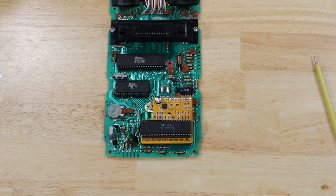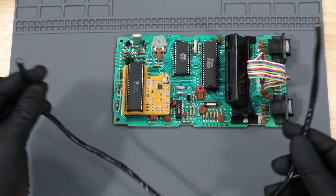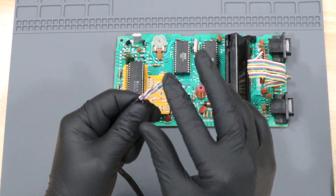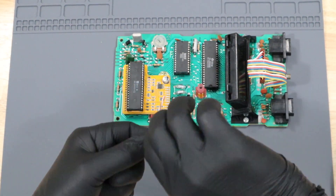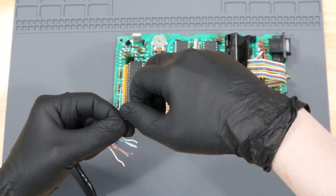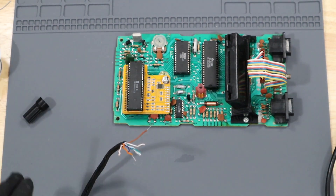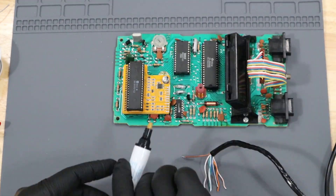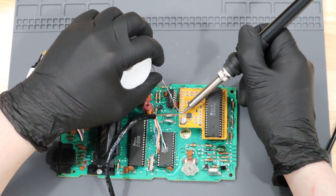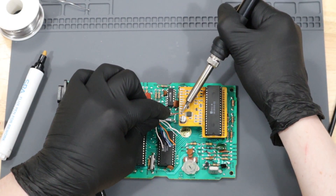Now with that installed, it's time to start soldering on the wires. The kit just came with a Cat5 cable. There are additional ground pads on this chip, so I'm only going to be using one of the wires for ground and just ignoring the other pads. By doing that I'll actually have enough wires to do this. There are eight wires in total that I'm going to solder: one for ground, two for the S-Video output, three for the composite video output — one for each of the connections — and two wires for what they're calling a pause mod.